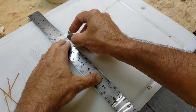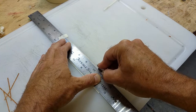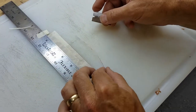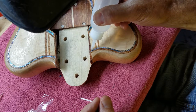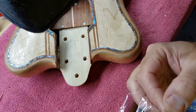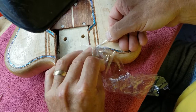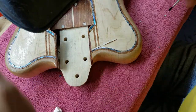This time I'm not going to tediously trace the outline as before. Instead, I merely cut the wood veneer into a bunch of 2mm wide strips. The wood is flexible and pliable, so this time we can shape it as we go. A slightly different technique is now called for when we're putting this wood veneer down. First drop a small blob of the thick glue at the start, preferably where there isn't much of a curve. Then place the end of the strip in place, hold it down with the cling wrap, and activate it with the accelerator, so that you've got the first quarter of an inch or so glued down.